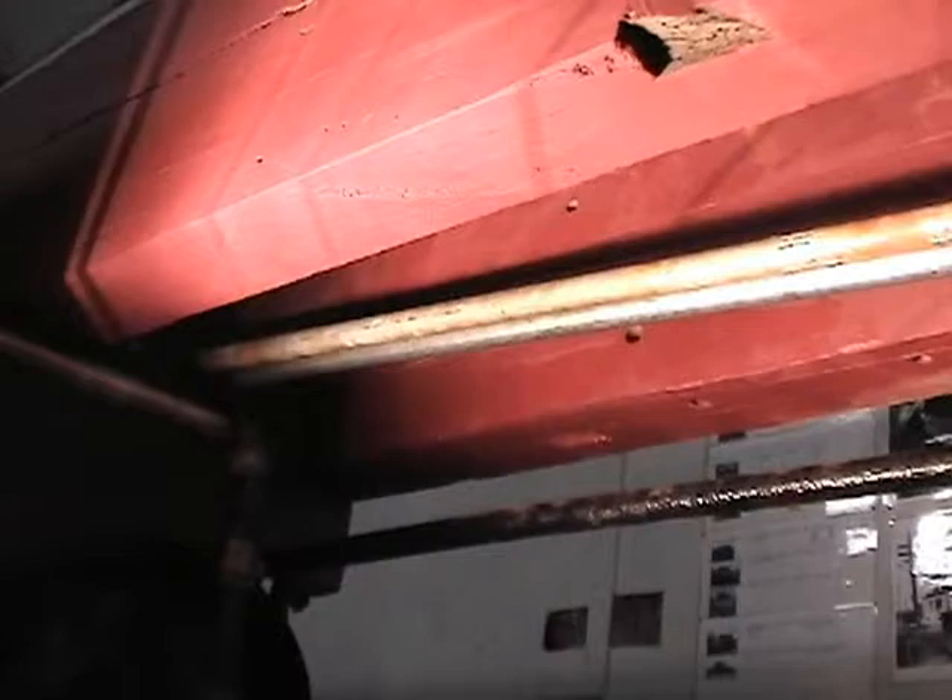These sills are now all painted with a protective coat of stain, the same color as the original. There are a lot of holes because the wiring was nailed to all of these sills — it ran along through here and across back through here. We pulled every one of those nails out; they were just large-headed shingle nails — ordinary roofing nails, no screws, through leather straps. On the single wires there were little brass straps, and we saved all of those because they don't make them anymore. We'll be able to use them when we rerun the wires. We took all the wires out completely so we could properly paint this, and then we will put them back — a lot neater than when we started.